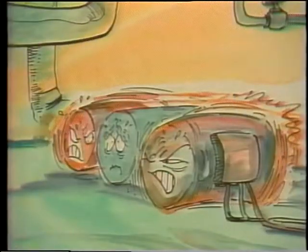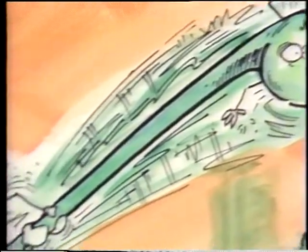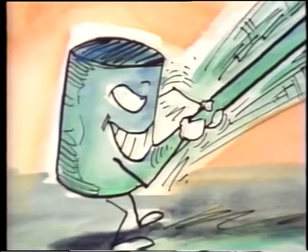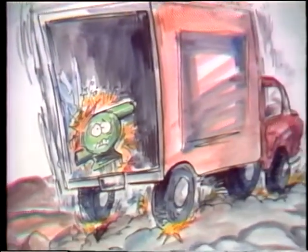False brinelling is caused by vibration that comes from someplace outside of the bearing itself. These outside sources of vibration include other machines running in the same area, systems connected by piping that telegraphs vibrations to the bearing through the machine casing, or vibrations caused by the movement of the machine when it's being shipped from one place to another.